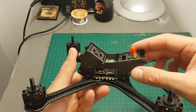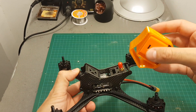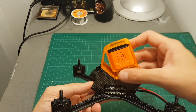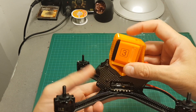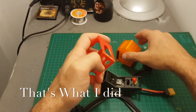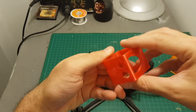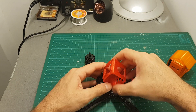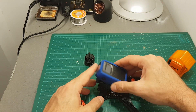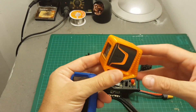For mounting an HD camera, there's already a 30-degree stand. If your mount already has an angle it can be difficult, as the angle may be too high or end up parallel. Preferably, get a flat case similar to the one included with the X215 that has no angle. Note that a Runcam Legend 3 or Runcam 2 will be very hard to fit — it's designed mainly for a Runcam 3, GoPro Session, or Foxeer Box.